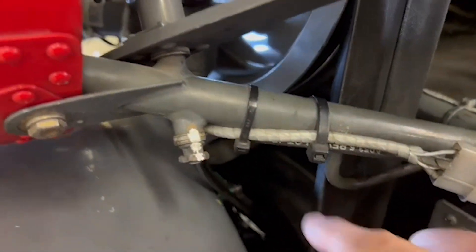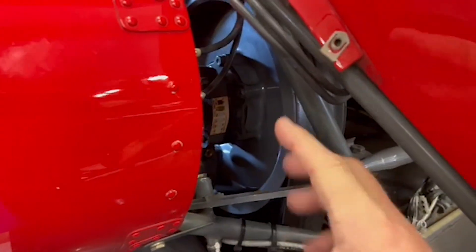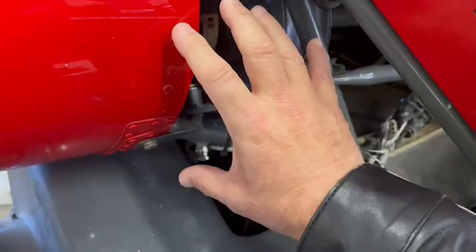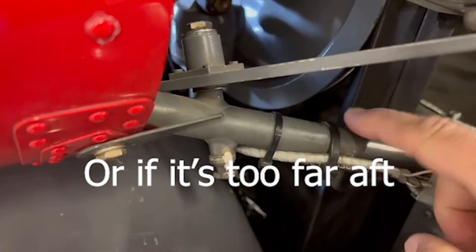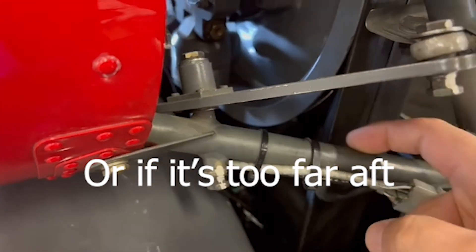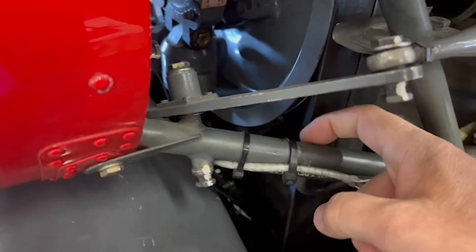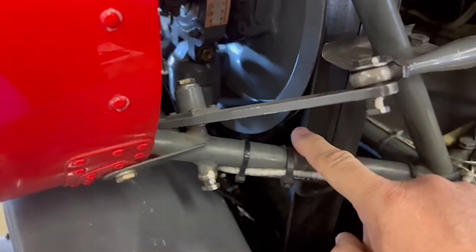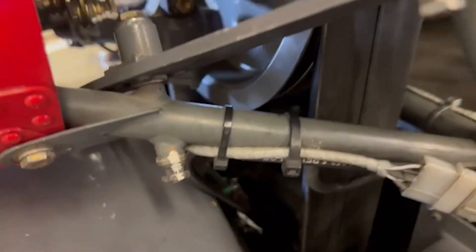How this occurs is if the upper sheave here has adjustments where you can move it to the left or to the right. If the sheave moves too far to the right, then this belt will actually come in contact - it's no longer in contact now because we've adjusted it partially - but it will actually touch the back of the frame right here and show this partial scuffing to the belt. It's very subtle, but you can see it in this case.